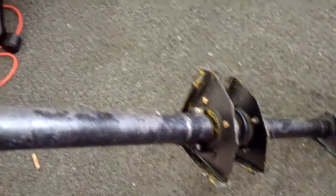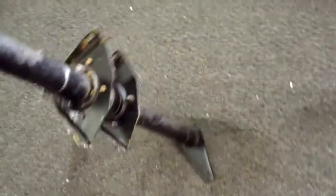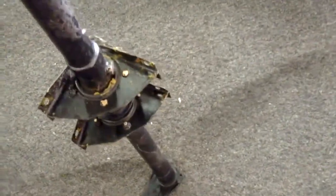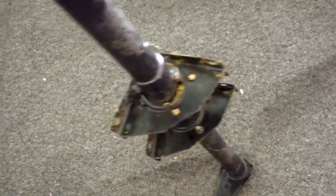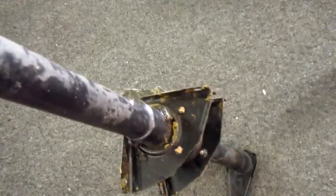As a side note on the torque tube — that receiver piece goes here in the center. These torque tubes are $1,675 from Fletch Air. They take 20 to 24 hours to replace in and out of the airplane. Pick a shop rate of whatever you like, and you can see you're talking a couple thousand dollars just to change this tube plus buy it. These torque tubes also have a core — the core is $400 with Juan or $600 with Steve. So at $1,675 plus Juan's core charge of $400, you're looking at $2,075. There's your motivation to inspect it every two years and make sure this isn't happening to your airplane. That's a little call-out on how to save some money.